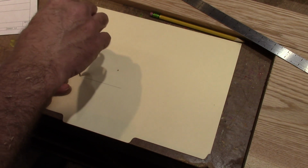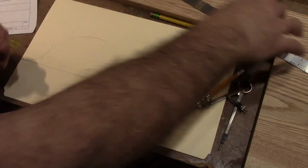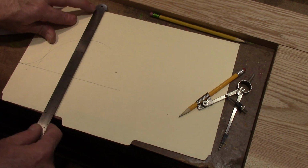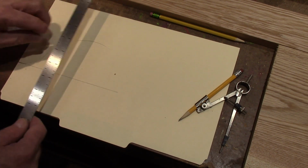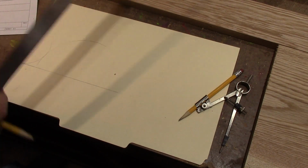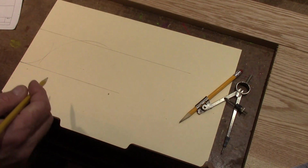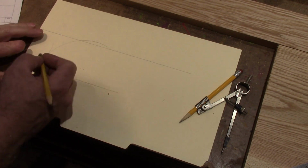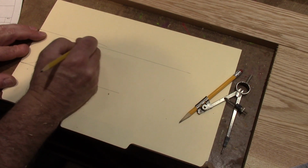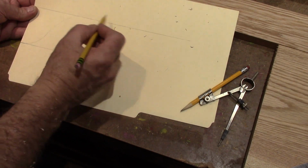And so then do that. And that's going to give me, so at 3 inches. So now if I come down, since my apron is 3 inches, I'm going to mark that right here. Take my T-square and draw me another line across like that. And then when I erase this stuff, so that's going to be my curve right there.